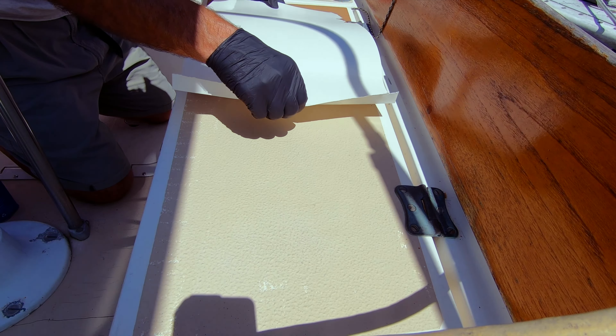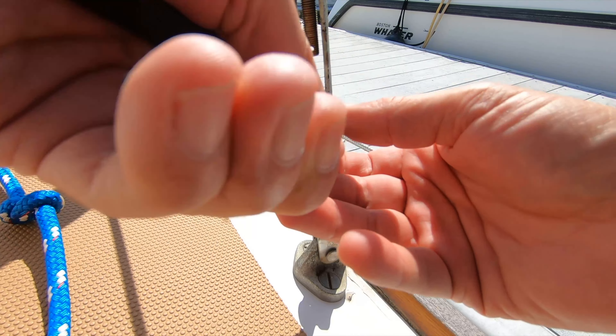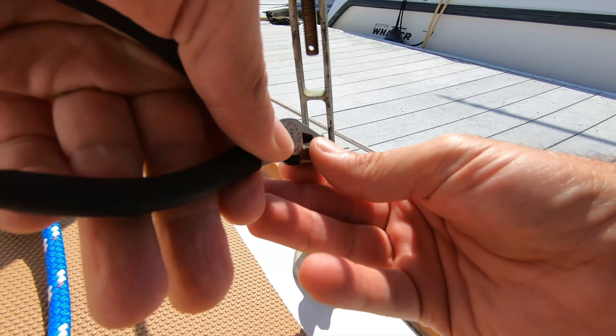The two benefits of this material that I saw over a traditional non-slip surface are its superior non-slip properties and the six millimeters of foam that impart a nice cushion to your step. I've read reviews on both ends of the spectrum for this product, followed manufacturer guidelines on best practice installation, and hopefully it lasts a few seasons of cruising — and if not, it wasn't a $600 mistake. Next time I start replacing my standing rigging with the mast up, I install a boom vang, and my electronic autopilot arrives. Thanks for watching — please like and subscribe and I'll see you soon.